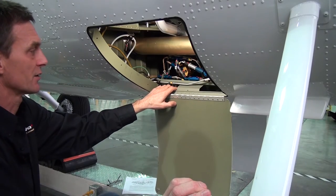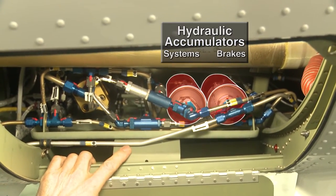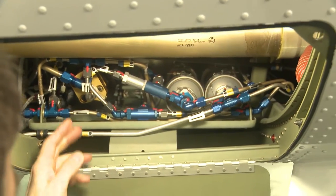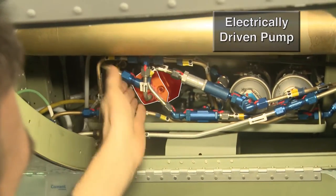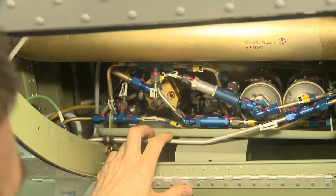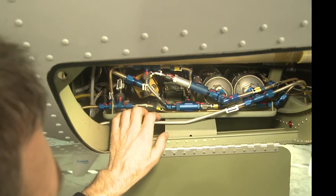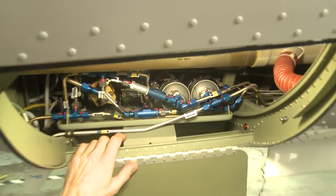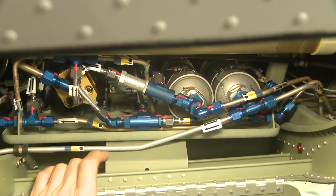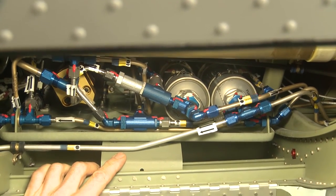This is the other side of the hydraulic power pack assembly. It gives us a good view of all the hydraulic plumbing and the check valves. These are the two hydraulic accumulator assemblies, and we can also see the hydraulic pump assembly being driven by the electrically operated motor, as well as the filter housing. These two hydraulic accumulators are interchangeable — same part number — so if you're troubleshooting, you can actually interchange the two accumulators.